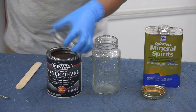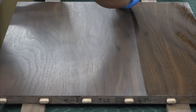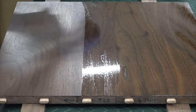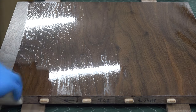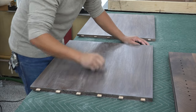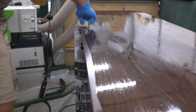I sealed and protected this piece using a 50/50 blend of Minwax's oil-based polyurethane and mineral spirits — essentially a shop-made wiping polyurethane. I wanted an easy-to-apply finish that could be polished and buffed out to a perfectly smooth surface. To apply the wiping poly I used folded cheesecloth, wiping on the poly with long even strokes going with the grain. I allow each coat four hours to dry before sanding off any dust nibs with double-aught steel wool. I built up about six coats and allowed about a week for the finish to fully cure before beginning glue-up and assembly.